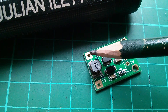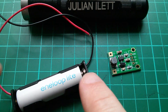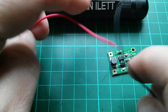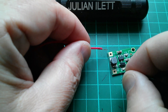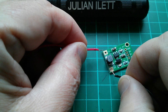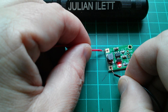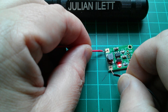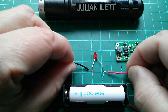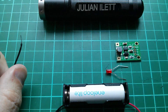All I need to do is put a low voltage on the input side and see if that LED lights up. I'm going to use a 1.2 volt nickel metal hydride - this is actually an Eneloop Lite. Getting the polarity correct: ground on there, 5 volts on there, and we have a little red LED. Now that doesn't really prove we've got 5 volts on the output. Would a red LED light up on 1.2 volts without the boost converter? Well, let's try it - no, a red LED won't light up on 1.2 volts. So we do need the boost converter to provide the higher voltage.